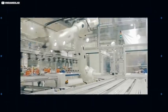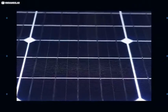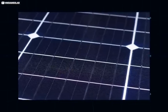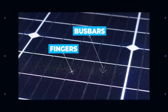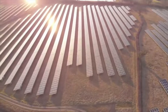Another downside to more bus bars is the soldering process. Sticking these strips of metals to the solar panel can create microcracks in the solar cells. The expanding and contracting strips of metal also cause movement within the solar panel that may increase the microcracks. But if you live in Texas, those solar panels are going to go through hell and back on your roof — you really shouldn't factor in the microcracks as the decision factor when going solar, unless you're interested in solar panels that don't have any bus bars.